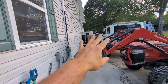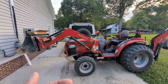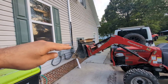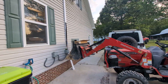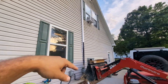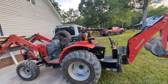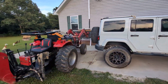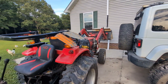So this is it fully installed. I'm about to turn it on. I put all the flex pipes, the drain-out pipe, plumbed it all through, got everything cleaned up nicely. The power cord still needs the clamps, and this will be switched out. I've just bought the pull-blade fuse, and I'll be reconditioning my 50-amp service into a 20-amp supply for this unit.